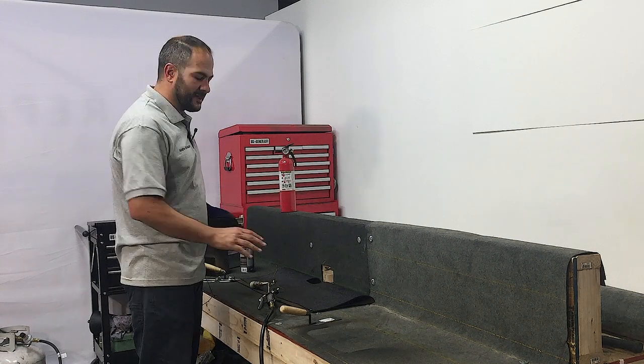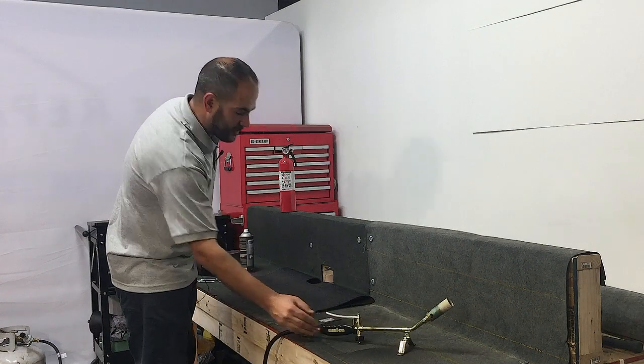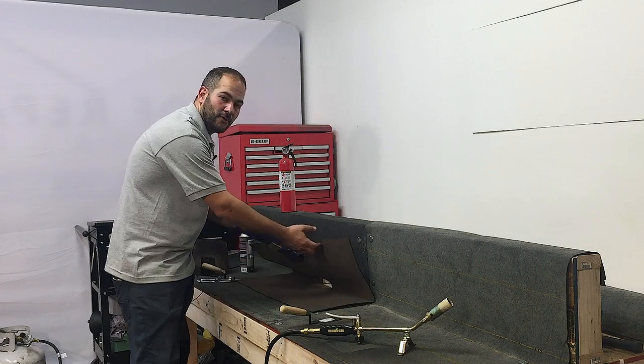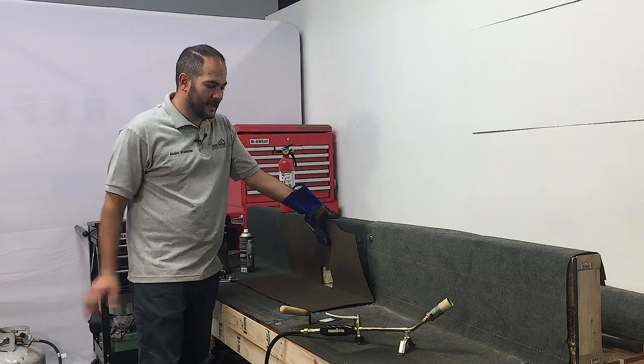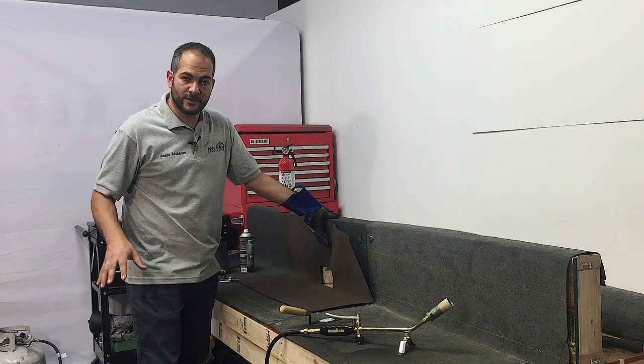So the nailing pattern on this is not perfect, but that's not what we're showing today. Now this roof, we're going to be installing a double layer at the penetration. Since this is the weakest point of the roof, the rest of the roof is not going to get a layer of smooth torch down, but this specific area is, along with the rest of the penetrations.